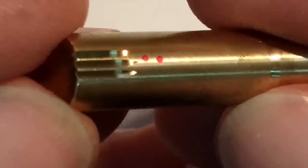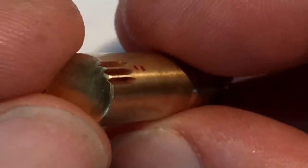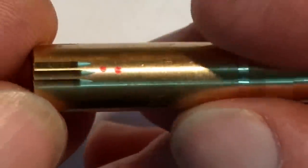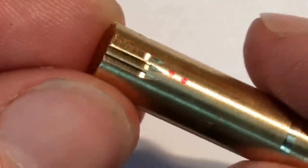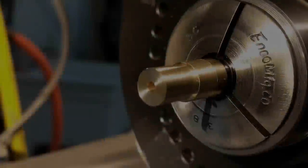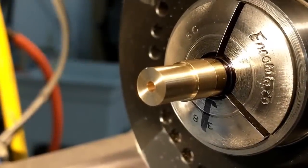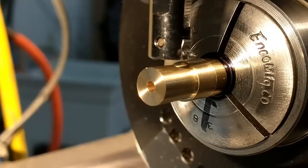If you have a horrific burr and the diameter of your part increases drastically over the burr, then the back side of the tool is rubbing. I spent some time relieving the tool — that is really hard to get in focus, I apologize. I spent some time relieving the insert I've selected, so it's got a really narrow edge. That tool is not specifically designed to rotate; it's designed to stay stationary while the part rotates, so the part falls away. If you're going to use a tool other than how it was designed, make sure it's going to perform as intended and that it's safe to do so. The blank is prepared — that is at 0.325-inch diameter, about eight millimeters. Knowing the profile of the tool you're going to use, come down and bump the part with the tool and zero everything out, then do your math and bring the center of that cutter down to where you need it.